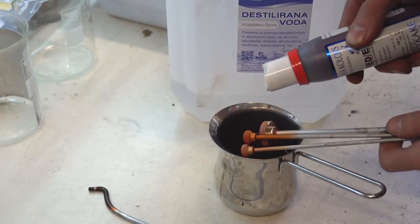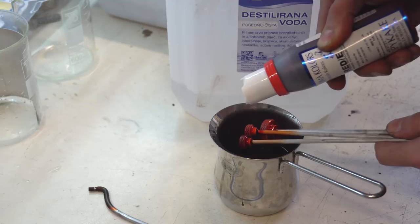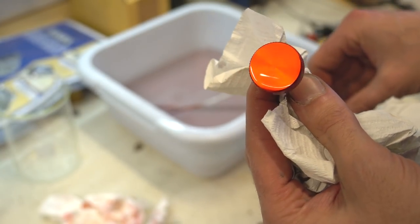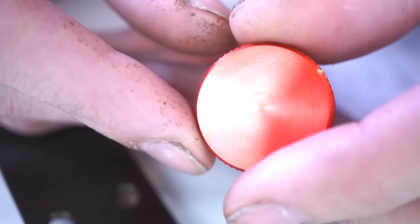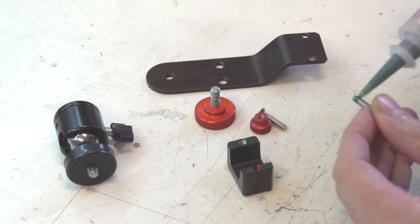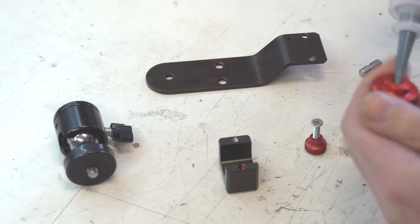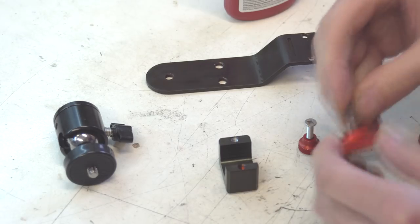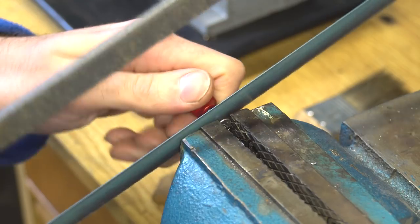When I got anodized parts I add distilled water into the container and add some cake color. After a bit of boiling I got some really nice results. The black color got a bit of red pigment, but that red knob is just awesome. And now I can glue the screws in with thread-lock, which holds them rock solid in place. When it's glued, leave them overnight then cut away and fix the end of the thread.